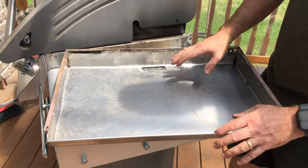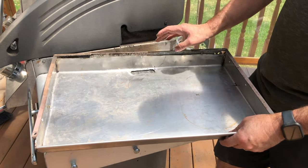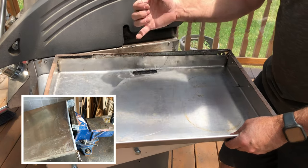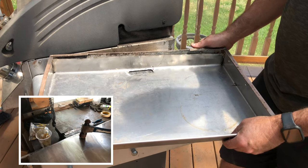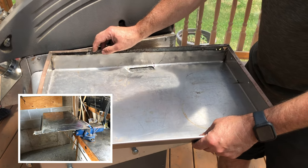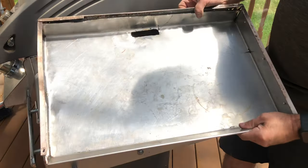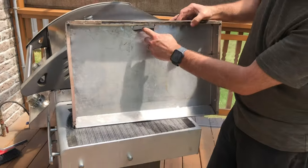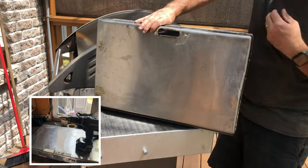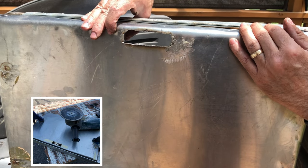The bottom rotted out, not the sides. So once you have your little pan and you're able to bend it into shape, what you're going to do is mark it all out, put it in your vise, bend it as much as you can, get the right bends in it. This is stainless steel, so I was using a grinder with a diamond bit to cut it. Once you have your measurements, drill two holes, then grind it out and clean it up with some file work, and that's it.